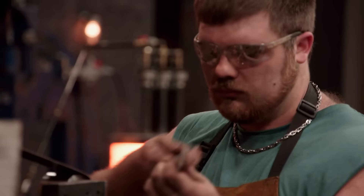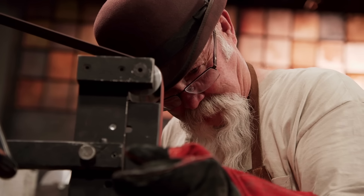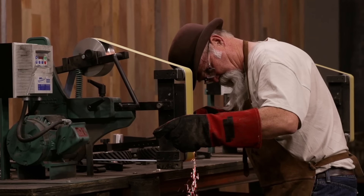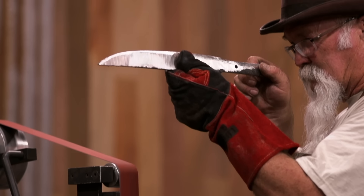I do like the fact that all of our smiths at the one-hour point are on the grinder. Frank's knife is really thick — he's got a lot of grinding to do. Before I heat treat, I like my blades to be on the thicker side. The thinner my blades are, the more likely they are to crack or have distortion. If I get a crack, obviously it can be catastrophic.